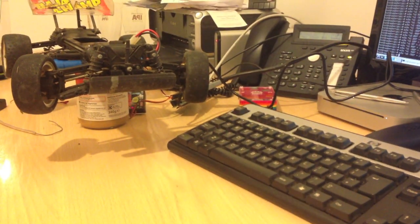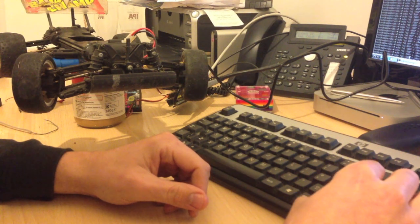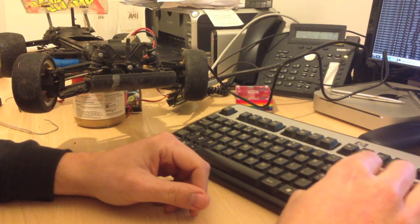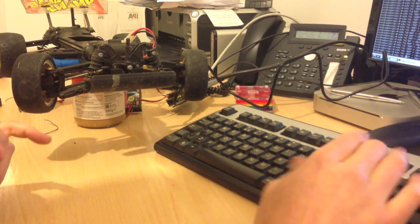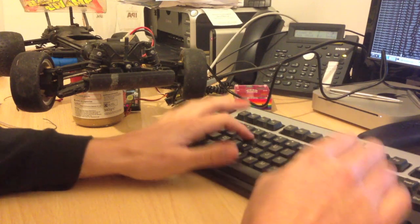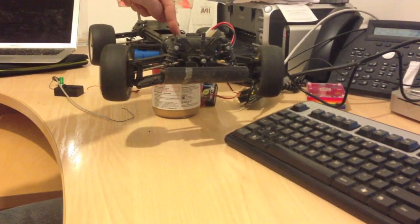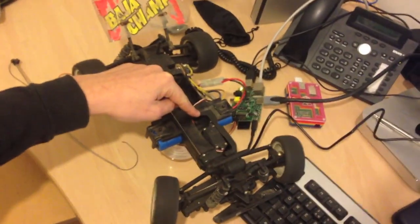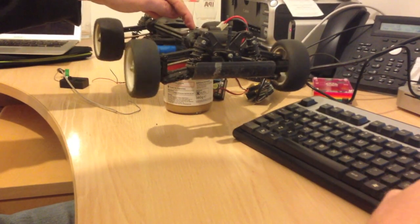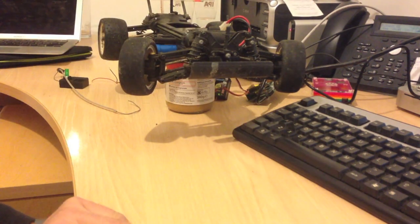At the moment I'm echoing serial commands out over to it just on the terminal, but the plan will be to do a bit more — I'll tell you about that in a minute. I can control the position of the wheels: this is all the way to the right, and by giving it another command I can tell them to move all the way to the left and back again. There's also a servo test program built in which cycles all the servos between 0 and 100%, or minus 100 and plus 100%.